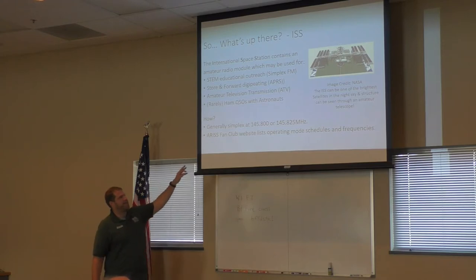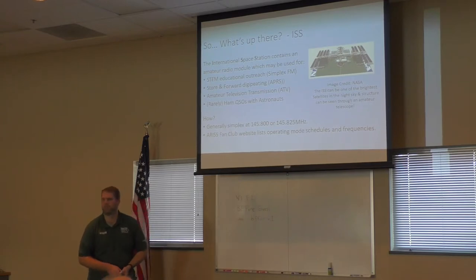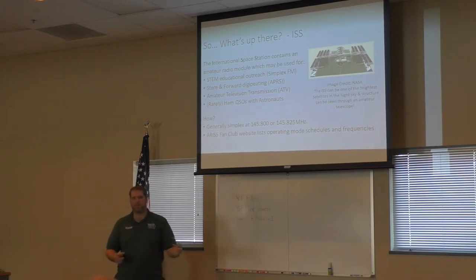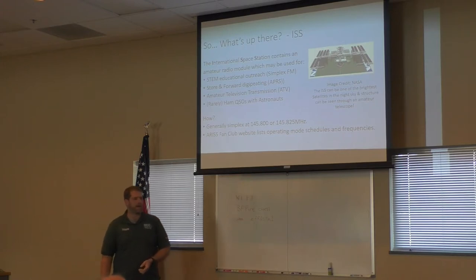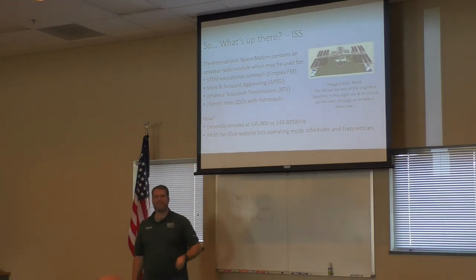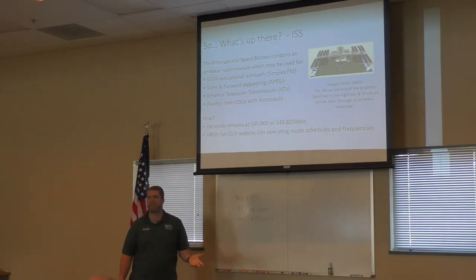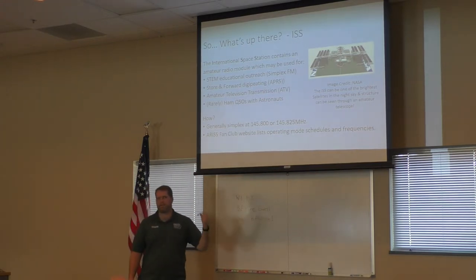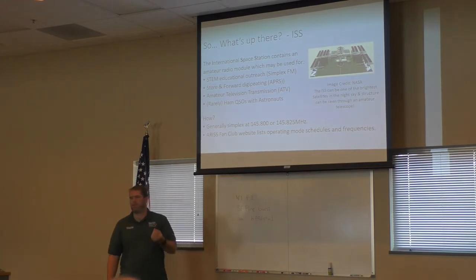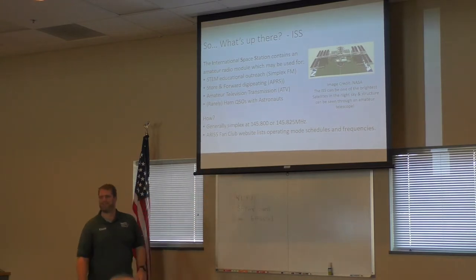They also have this simplex frequency that you can send up packet radio, the old AX.25 tone modem, digital mode, okay? And what's cool about that is you can encode your location through something called APRS, Automatic Packet Reporting System, right? And you send out this packet, you can watch the dot moving that you're sending to and point your antenna if you're doing it manually and it happens to be a visual pass. You don't need a huge amount of gain for the ISS though. It actually is one of the easier ones to work. It goes up on 2 meters, and then a couple seconds later, you'll hear a packet that's you, again, going down. Somebody listening on the ground, connected to the internet, just like in Echolink, will forward that over to a database, and up pops your position on a map through space, which I always thought was kind of cool.